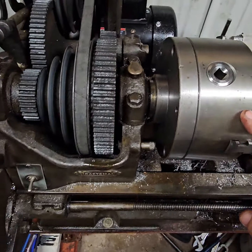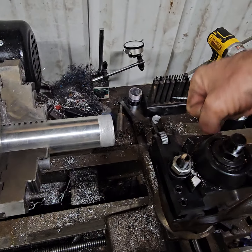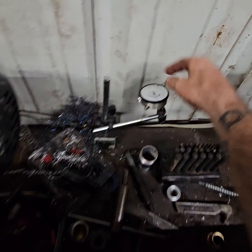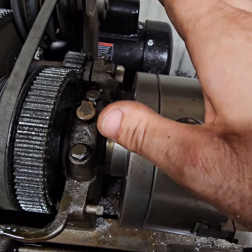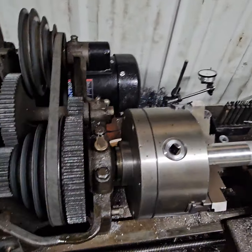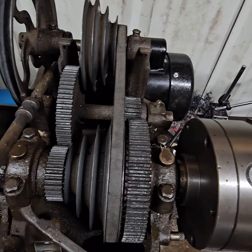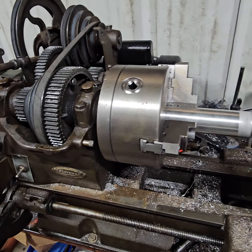So essentially what I do with the Babbitt bearing is I chuck up a piece of metal in here and I pull up and down on that, with the dial indicator giving me my up and down reading, and that's how I know I need to take a shim or add a shim. If you take out too many shims, if I go lower than 1.5 thousandths, the caps get a little warm after about a half hour running. The extra friction is not worth wearing out my machine.